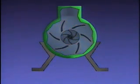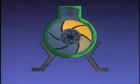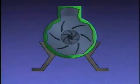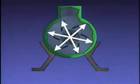The vanes create a series of widening chambers that convert the kinetic energy into pressure in the same way that a volute does. The diffuser vanes direct the fluid outward in all directions as it leaves the impeller. The main advantage of the diffuser is that radial thrust is minimized.